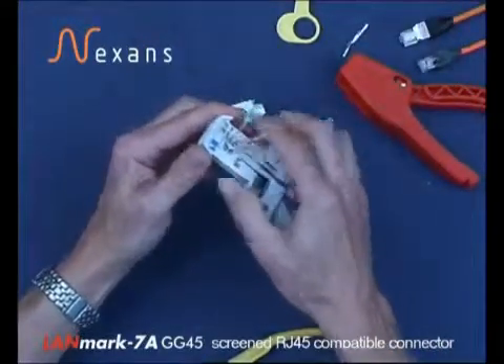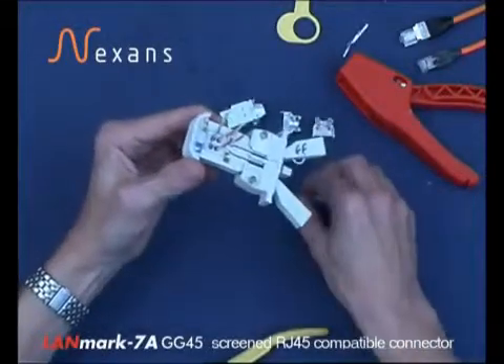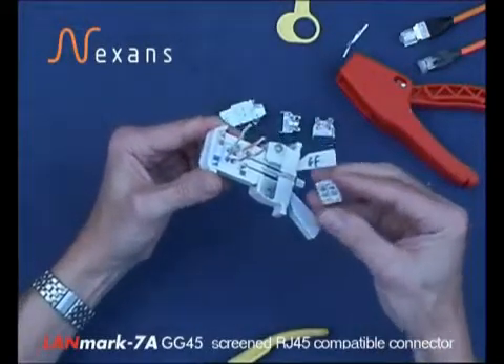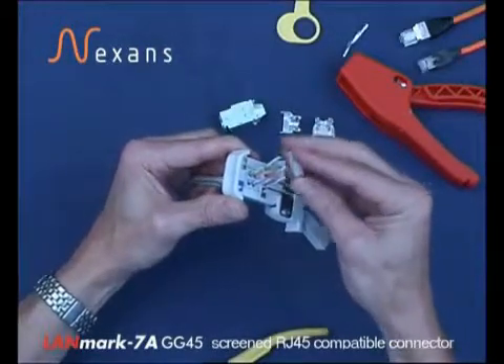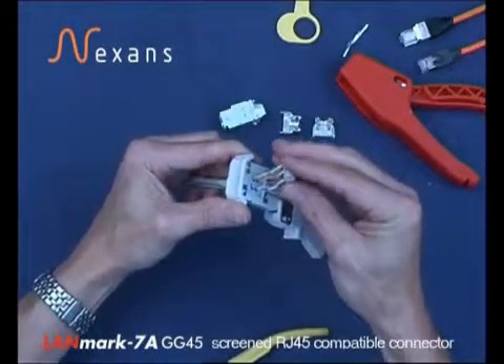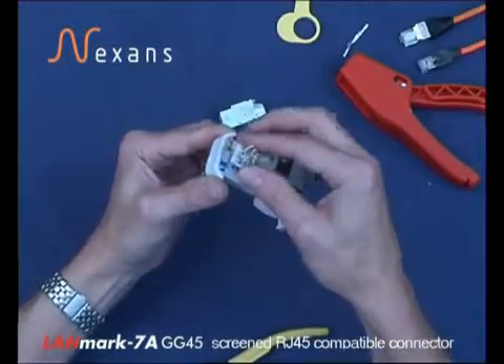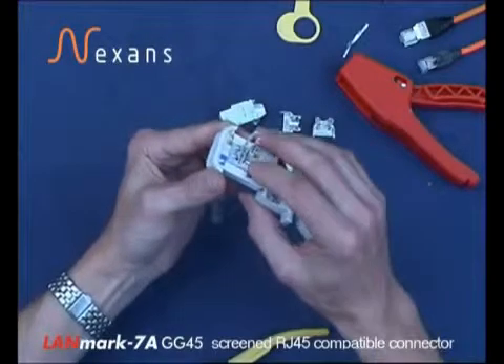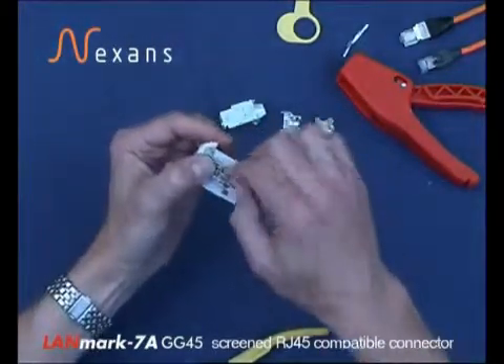Move the shutter back, draw the cable down into the tool, and we will place the wire manager over the cores following the correct colour codes. Sliding it down onto the tool, pushing the cable gently up inside the tool so that the foils go inside.